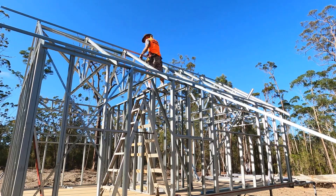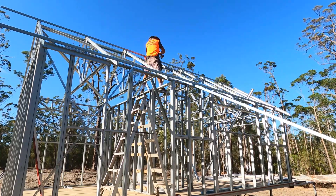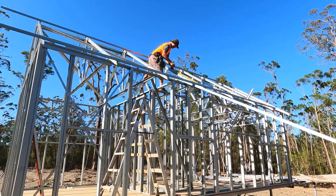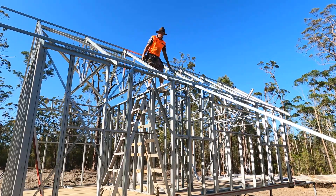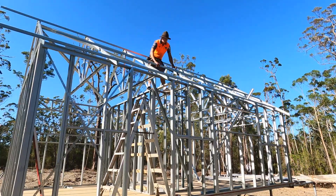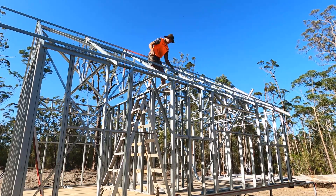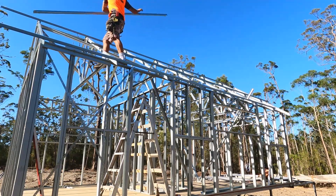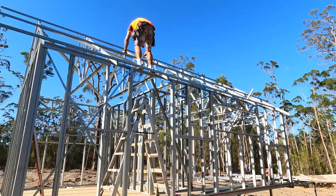When you're screwing down your battens, they get one screw on each side of the batten at every point where they cross over a truss. This helps keep the roof nice and stiff — once all your battens are on, it's like a big frame that all works against each other and holds it nice and stiff and square, stopping it moving around in the wind. You want this building to be rock solid. If it moves you're going to get cracked plaster or cracked lining on the inside. You want it nice and solid so it'll take any kind of storm.